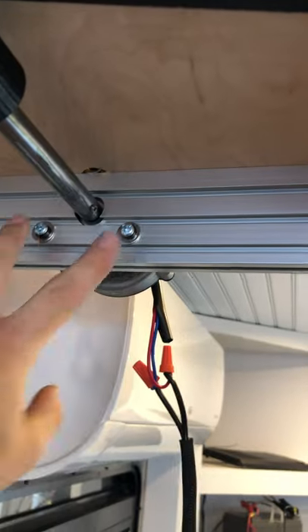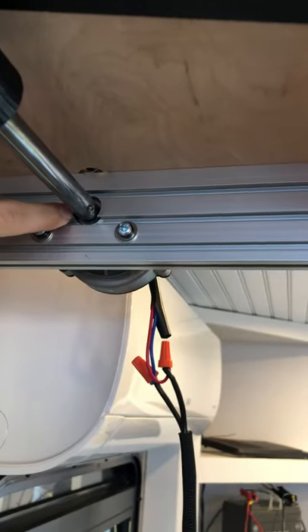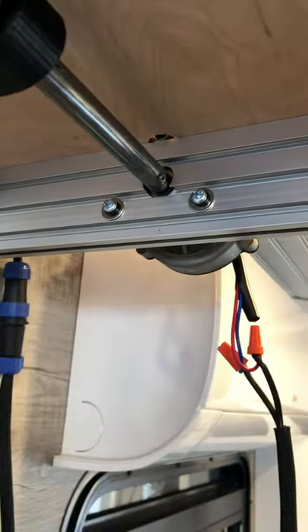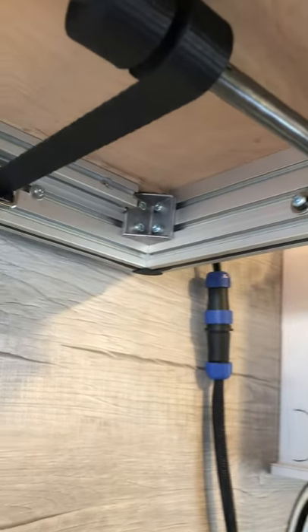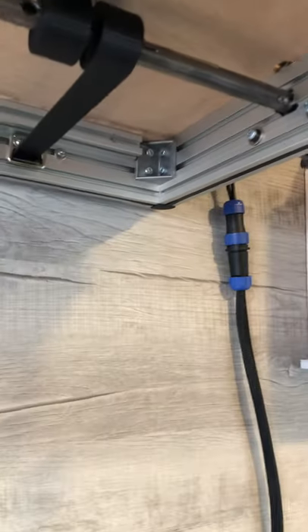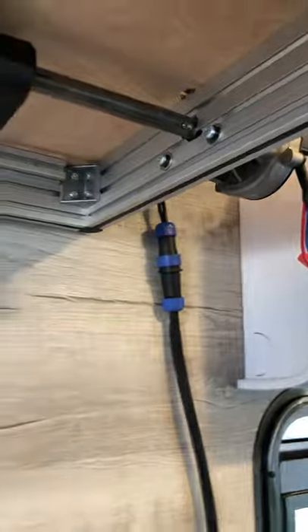For the motor mounting I used simple through-and-through bolts, drilling the hole for the boss of the motor — it does stick through a little bit. I did everything on a drill press just to keep things neat, but you can do it by hand if you're careful. I assembled all the corners with the actual brackets; you could also just use regular bolts through the ends. I kind of went all out on this build — I did the corners in round aluminum, capped them, and put filler on everything to make it really clean.